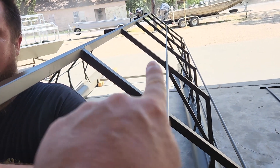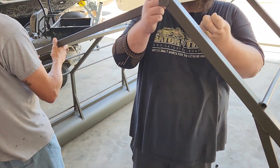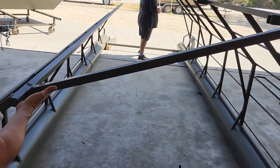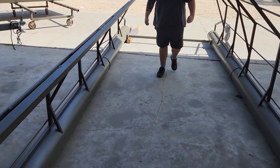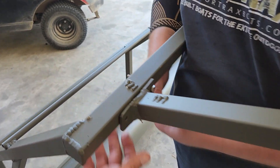That brace up in the very front goes all the way across — we bolted it in first. Now we're coming to the other end of the blind and putting up the brace across the top that runs all the way down. You'll notice they have welded letters on here — this is F to F, and on the other side there's E to E — so you know where these are going. This is the brace you'll duck your head under to go in, and it'll square the blind up so all the rest of the braces are easy to put in. We typically put the bolts in from the inside and let the nuts stick out on the outside.